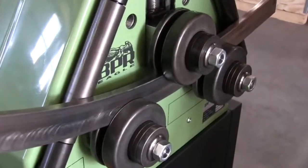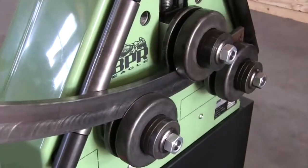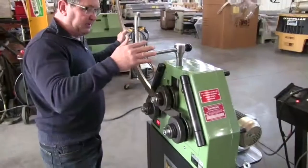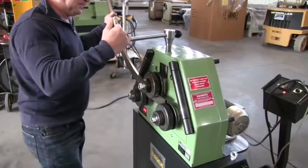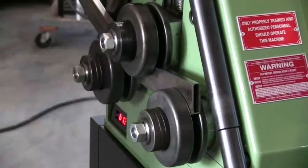The sidewalls look good, with the exception of the scuffing, which we can correct with nylon tubing. Let's measure our central cord, 2 1/8 inch. And again, I'll just do a tighter and tighter pre-bend using the rolling force of the machine. Alright. Let's try this and see what we get.